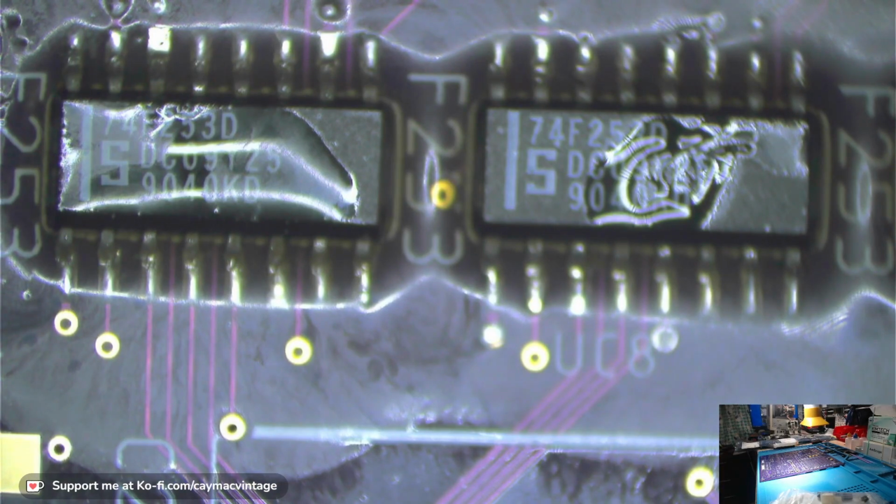Here's some of the resistor packs that I need. I don't need the 22 ohms because I put those on. I'll need the fuses. Won't need that. More LS30s. One K resistors on resistor packs I'll need. 393. This board doesn't use 393s. Why do I have this in here? This I'll need. I'll need this because I need to replace the FPU.